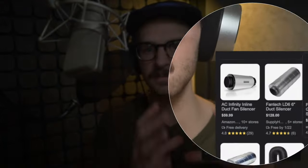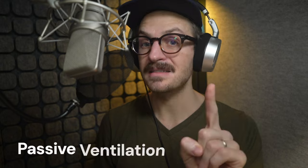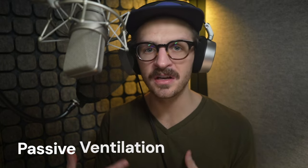You can build one of those yourself — there are lots of tutorials and walkthroughs here on YouTube. I made my first one via a tutorial on this site. You can also buy duct silencers, which look like little tubes you plug onto some ductwork. It's essentially a tube with acoustic treatment that eats up sound as it moves through it. How would you set up your ventilation with these silencing ducts? There are two ways. One is passive ventilation, meaning there are no fans moving air into or out of your booth — it's just air moving on its own. The beauty of this is physics: hot air rises.